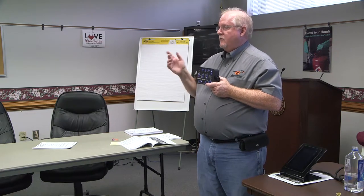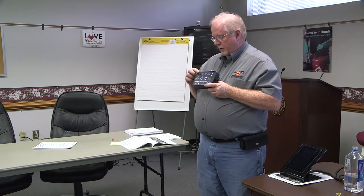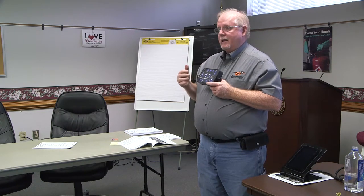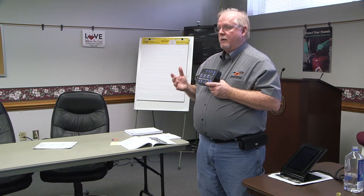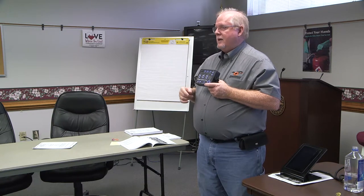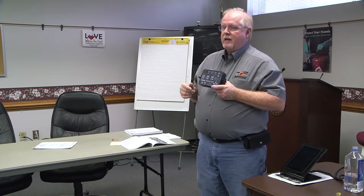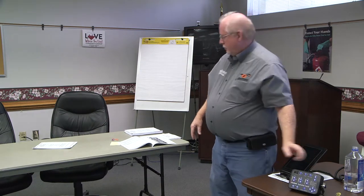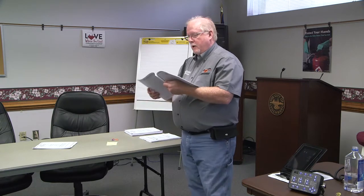So that's a good troubleshooting tool. If a driver calls up and says, 'I've got my system turned on, but I'm not doing anything and I get a light that blinks every once in a while,' you need to find out which light it is. Because when it brings the truck back in, you've got a circuit you can chase down and figure out which one it is without opening the whole can of worms. Whichever one is blinking — that's the one that could be at fault.